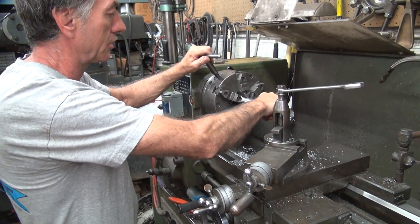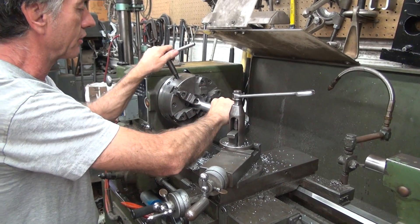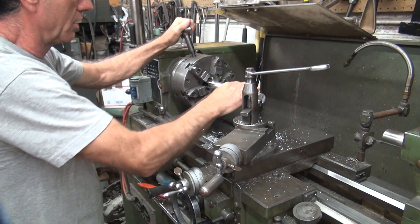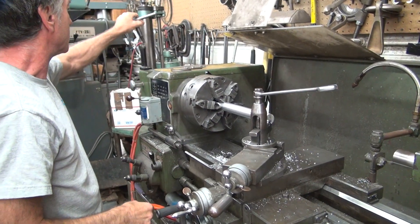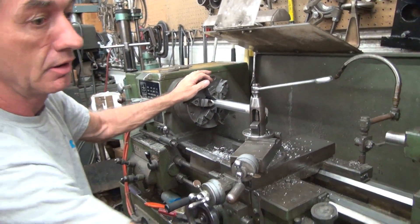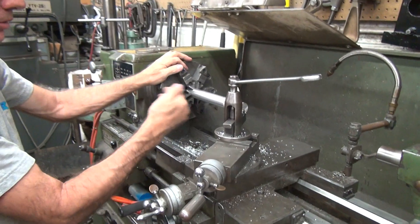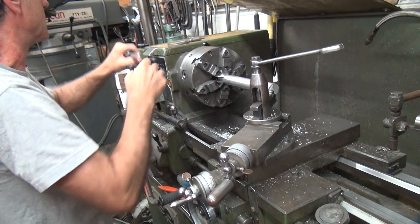Nice and solid pretty much. See it moves a little bit. That's because the chuck jaws are not straight in there — they come out to the outer ones. These jaws are like this. I tried cutting them around straight but I don't have tools. They really need to be ground. These are heat treated — it's hard to cut. Especially when these are more and more that long. See the rear? It shakes. Every time it hits it bounces over. I was taking real light cuts but it wasn't working too good. I'll have to make another go at doing that.